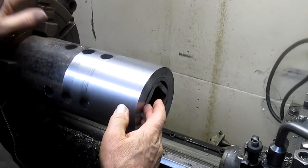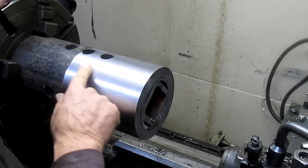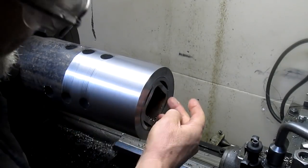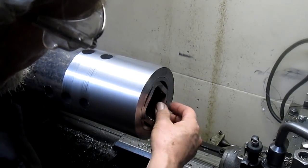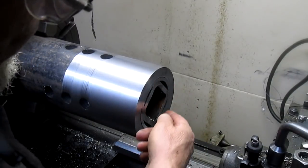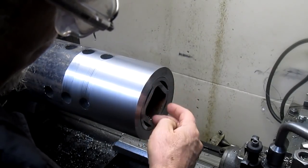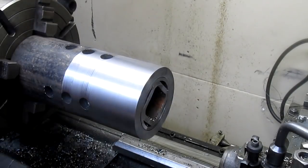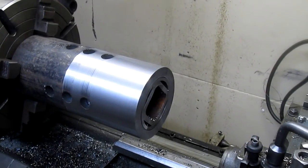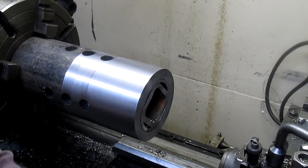One last thing I want to do here before I disconnect this: we're square up here, we're square here, but this square here is a pretty ragged edge. So I want to come in and cut a 60-degree cone in this. We're sitting at 45 degrees right here. So actually we're going to cut it at 30. 2 30s is a 60.